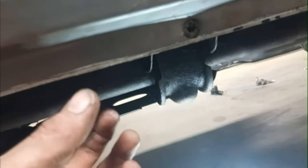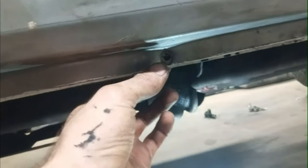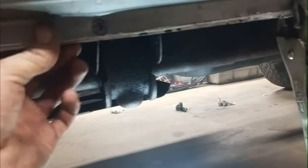If I squeeze it with a pair of vice grips, they kind of miss the line even worse than it is there. So I drilled a hole, and then it'll squeeze it straight with a bolt. Then I went along and drilled a hole through the one side, welded that, drilled a hole through the back, and welded that. Now I just got a pair of vice grips holding it once I took the bolt out, and I'm going to weld that up.